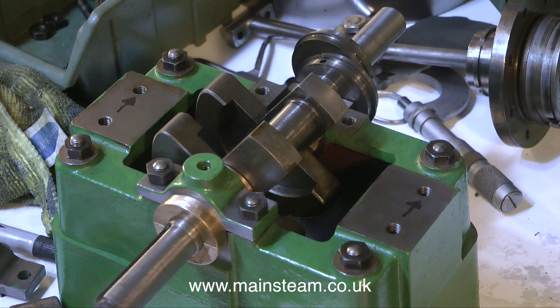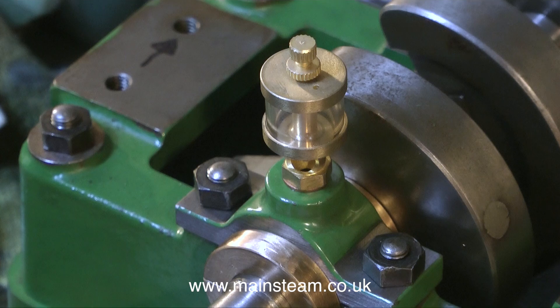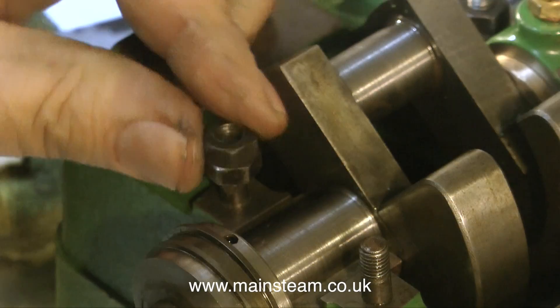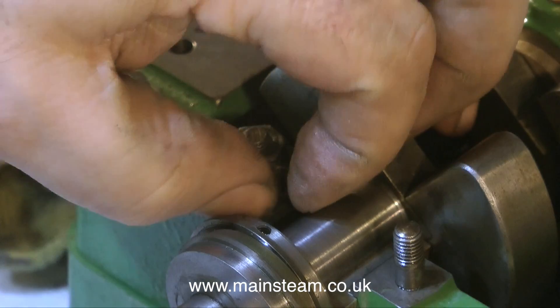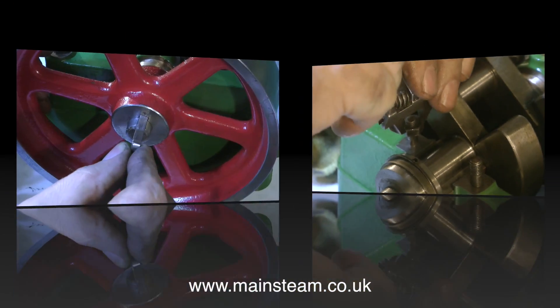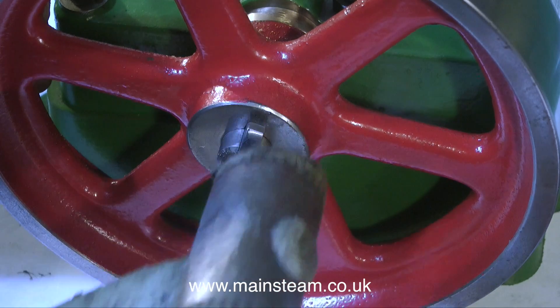So that's one side done — now it's time to work on the other side. I think I'll treat the engine to something that's going to make it look a lot better: these are glass drip feed lubricators, which look a lot better than the other ones that didn't fit anyway. These glass and brass drip feed oilers are available from a company called 21st Century Steam, who generally sell on eBay. I'm using a pair of lock nuts together to allow me to screw in and remove the studs to get the correct length.